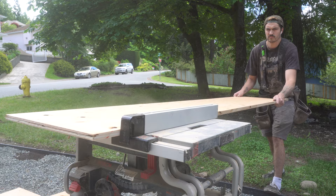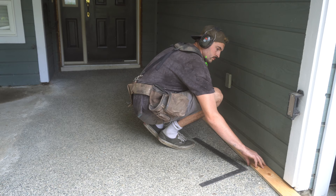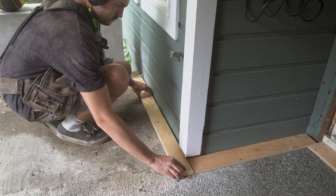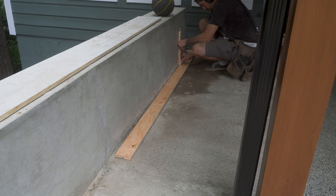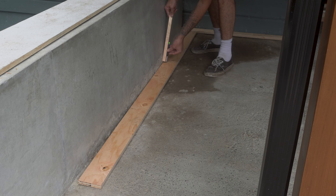As I'm building the pavers on top of an original concrete slab, I began by laying down the four inch strips in a single layer around the whole perimeter. The reason behind the four inch strips isn't just because of the design — it also helps draining the rainwater away from the house. Any rainwater that gets onto the pavers should find its way into the four inch gap and then drain away from the house using the drainage holes in the concrete wall. I also scribed the four inch strips around any bumps or inconsistencies around the perimeter.